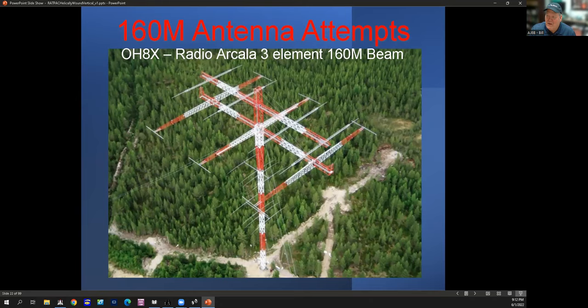This is just a few of the cobbled-together pictures of it at the time — nothing very fancy, but it did work. It was flat enough: if you pick an SWR of three, which seems to be a magic number, this was pretty much flat enough across the band that I could use it with an amplifier. Over the two years I was using the inverted L, I made almost 1,800 QSOs, 40 entities, 15 zones, and had a WAS of 45 states. It performed well enough for me; I enjoyed it, got to learn the band, and got some good experience.